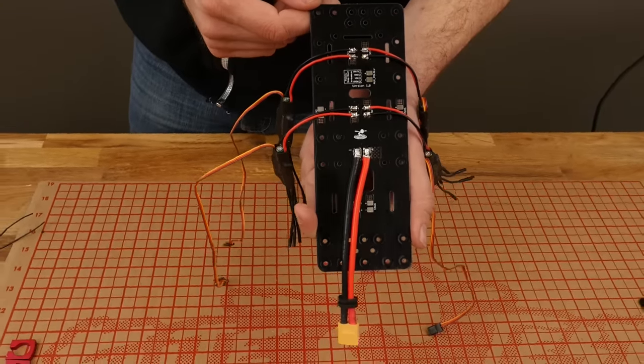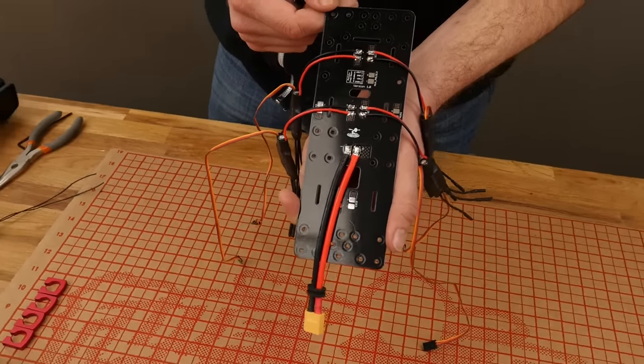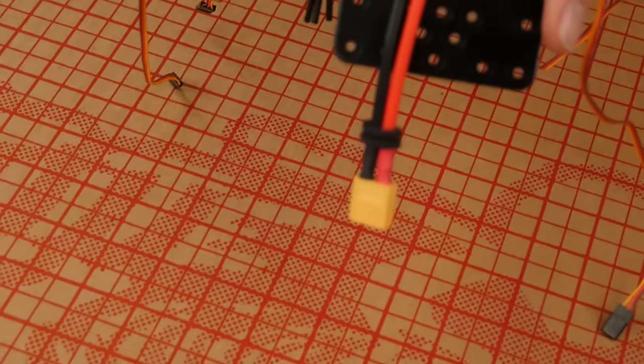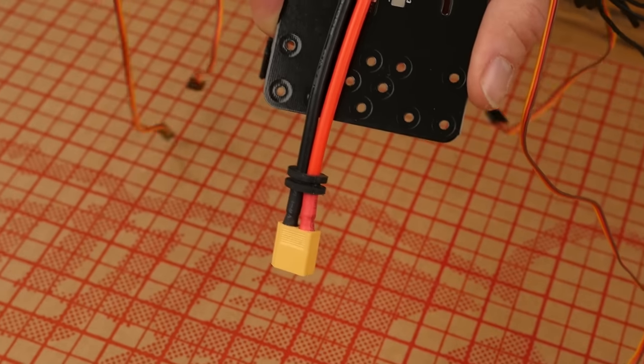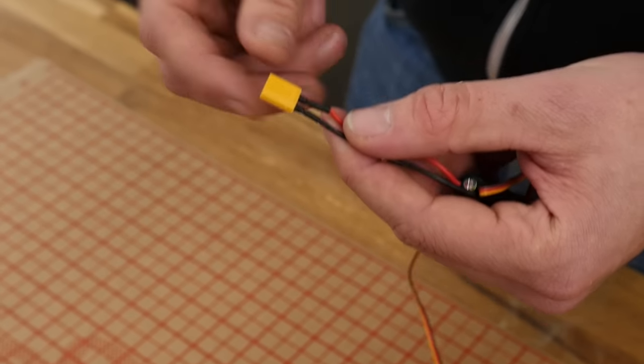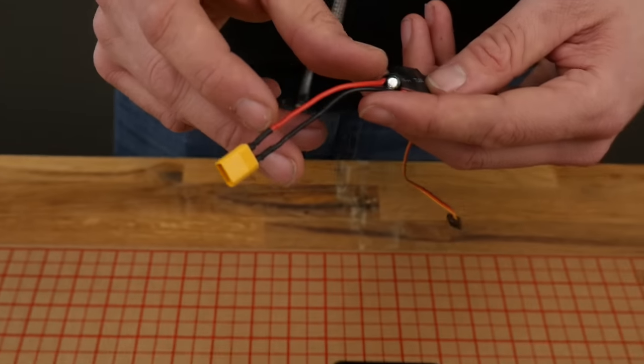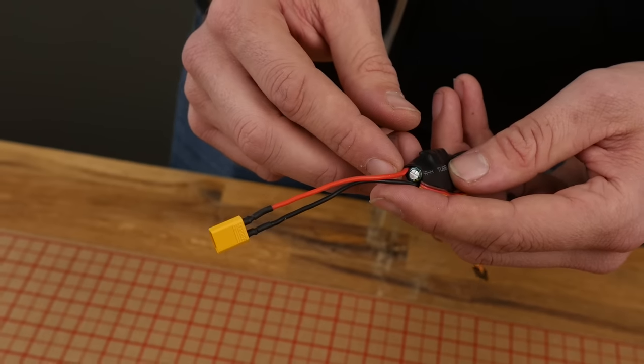In this portion of the video, we're going to be showing you how to prepare your wire leads on your ESCs, pre-solder both the wire leads and the pads, and also prepare your power lead and the ground that needs to be installed. The first step before soldering your ESCs, if you have the E-Pak, is to go ahead and remove the XT-30s from it — just cut those off, leave as much of the length as you possibly can. Do this on all four ESCs.